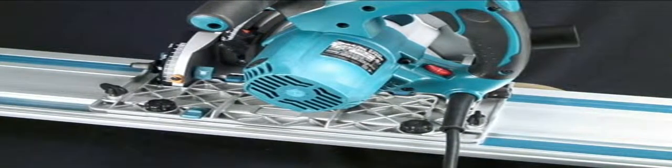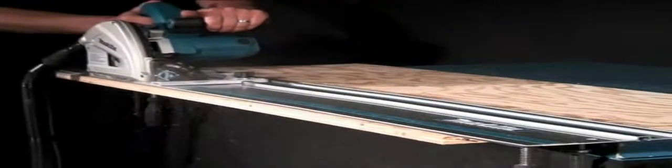This is particularly useful when starting a cut from an exact point, as the cut can be started without the risk of shifting. The ability of the SP6000 to make a preliminary scoring cut ensures that your work remains splinter-free and that no touch-ups are required. This is particularly important with materials that are easily splintered. Some examples are veneered materials, paneling products, melamine, and pine.